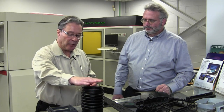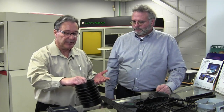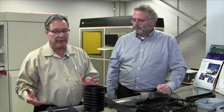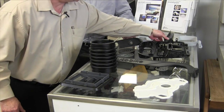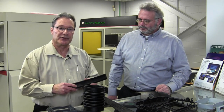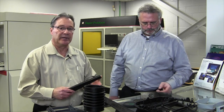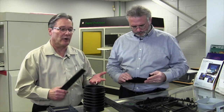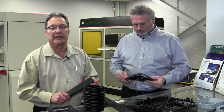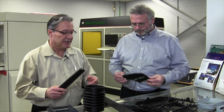Another area, while we're talking about softness or durometer as these materials are called, you can vary them across a really wide range — down to soft materials that I equate to jello, all the way up to very rigid, stiff, and strong materials. You can get some very high impact resistance with these products, as well as relatively high temperature capabilities. Some of the materials we use are rated at 340 degrees Fahrenheit, which is quite a bit higher than what urethanes had a few years ago.